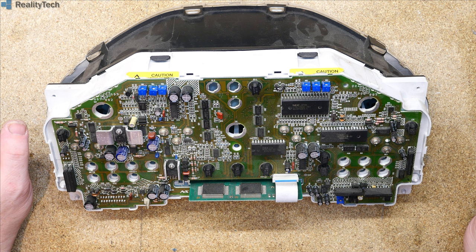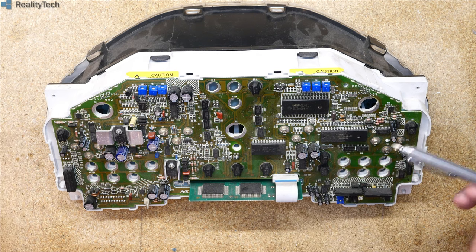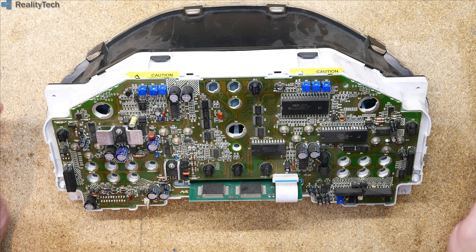Control signals out for the lights and various other things are handled by discrete logic. Again, not the way it would be done now. Looking at this from a modern point of view, yes, you probably still have a complete computer up in the dash. That's not uncommon, and with LCD based color dashes, you are almost certainly going to have a lot of processing power up there. But you'd have a microcontroller, so you'd have this and this all in one device. It would be using CAN. More likely you'd then use a PLD or FPGA to generate all your outputs and inputs.